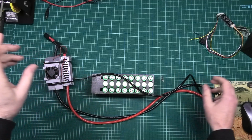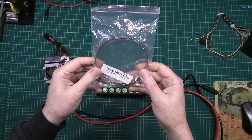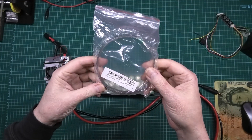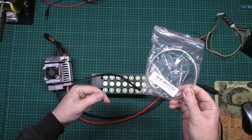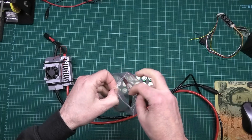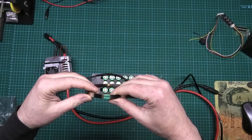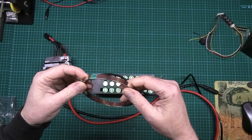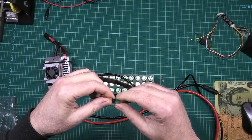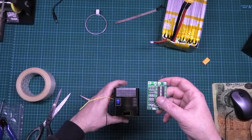I'm going to be using basic tools — stuff you can readily and cheaply buy. This spot welder and nickel strip are from Banggood. The strip is supposedly 99.9% nickel, which I doubt — it's probably about 20% nickel, likely nickel-coated tin. I'll leave affiliate links in the description for all the parts. The way you can tell if it's proper nickel is when you spot weld: if it gives off a spark, it's nickel-coated tin, not pure nickel.